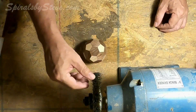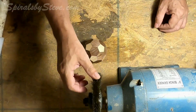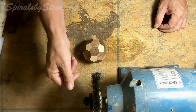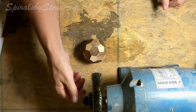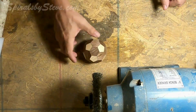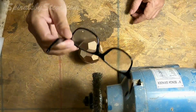This wire wheel that I used — as wire wheels go, this is actually one of the softer ones. It's brass-plated steel; a magnet would stick to that. And this grinder is a low-speed grinder — it's 1725 RPMs instead of 3750 or 3500. That worked really well for cleaning this up, and you definitely want to use eye protection while doing that.